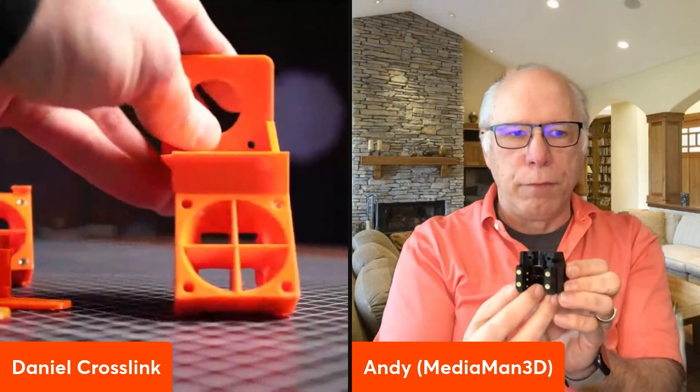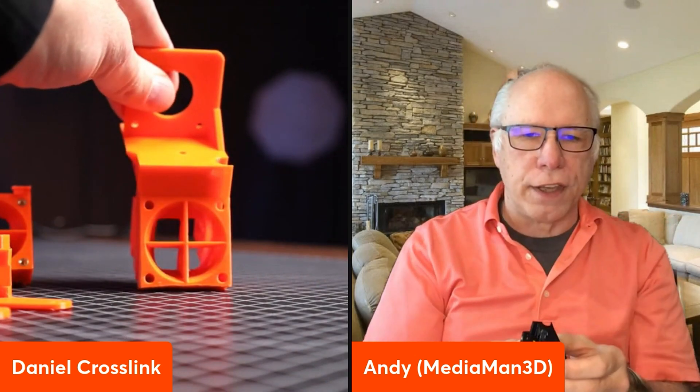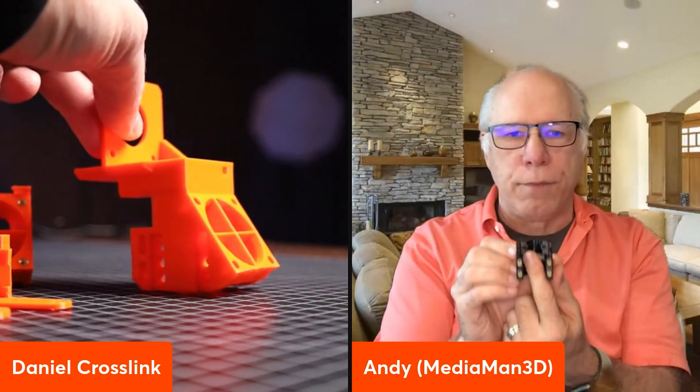There are other design improvements on Gen 6. Another big one is the heat sink cooling duct for the fan that sits on top. The vane work and the channel body has been changed between Gen 5 and Gen 6 to properly get the airflow through the center to the heat sink. The shape changes based on the different hot ends — it was static in Gen 5, but now it's more tailored to each hot end that's going to be behind it.